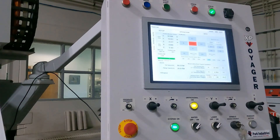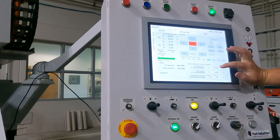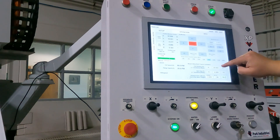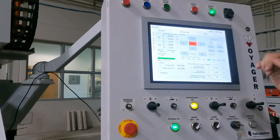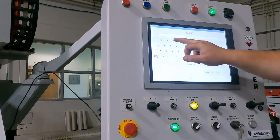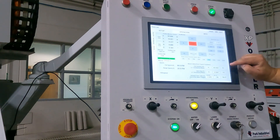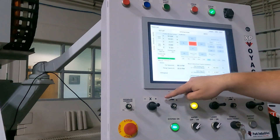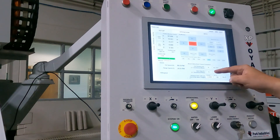Once you have the blade down, the cut distance — I could type in a known distance that I want the blade to travel right here. Remember, X is now the direction that the laser is traveling. So, if I wanted to cut for 40 inches, I could type 40 inches, hit OK, and go to plus. Because remember, plus is always towards where the laser is pointing. You don't really want to cut in negative so that you can avoid pulling the pieces up as you cut.